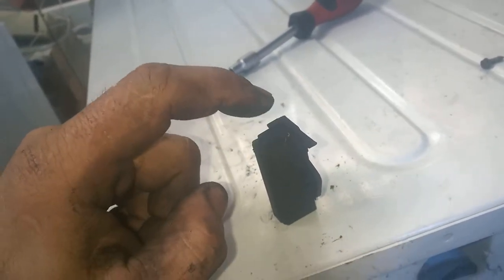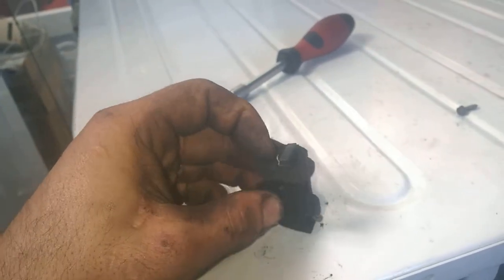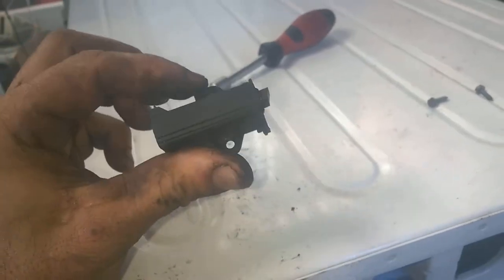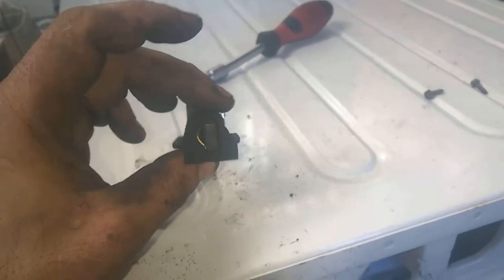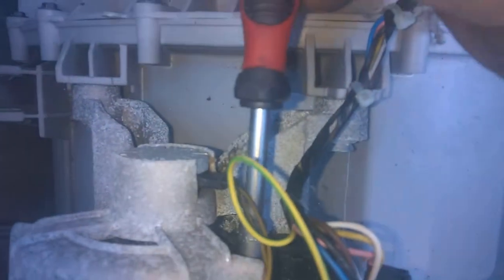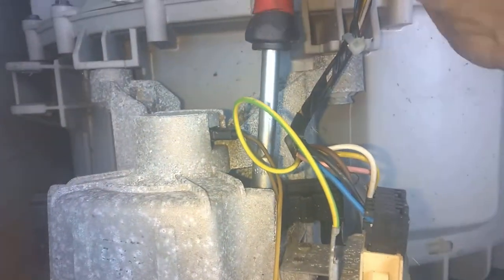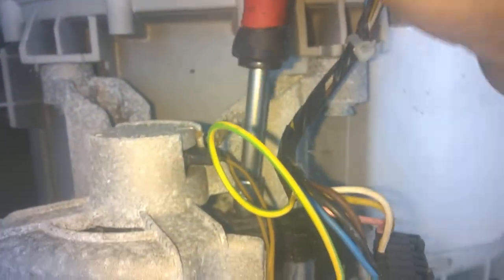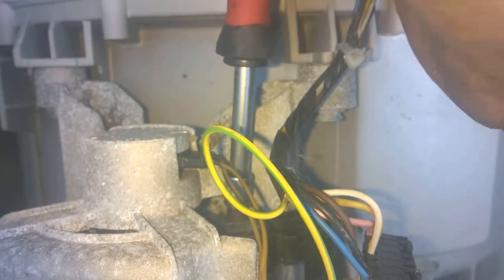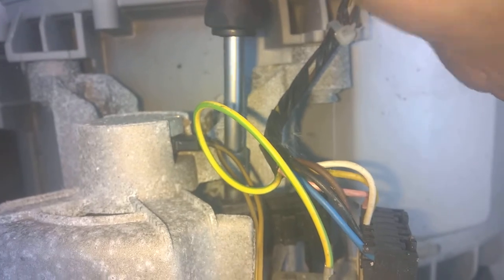I'm going to try to find some good used brushes around here, because I don't want to travel 20 kilometers to buy new ones. These are cheap, but I really want to fix this right now. Here we have a nice crusty motor with some compatible brushes — I'm going to remove them and see if they are any good. If you manage to find different brushes, you can remove the carbon part and make it fit on the casing of the old brushes. As long as they make contact with the commutator, you're fine. If they are larger, you can grind or sand them to make them fit.